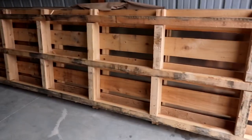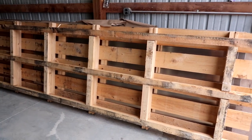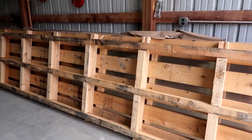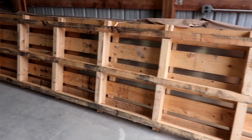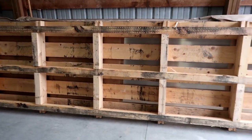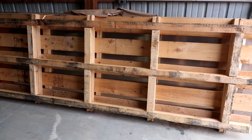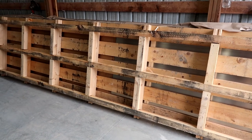First thing I need to do is rip down the bottom of my hull. I bought 25-foot sheets, three-sixteenths thick, 4 feet wide. To be legal for towing, you cannot exceed 8 foot 6 inches, or 102 inches. So I'm going to take these sheets and rip them down 4 inches so they'll be 44 inches, making the bottom of my boat 88 inches. The beam at the top of my boat is going to come up to right at 100 inches wide, so I'll have basically two inches to spare to be legal, and that'll give me a nice flare to the boat.